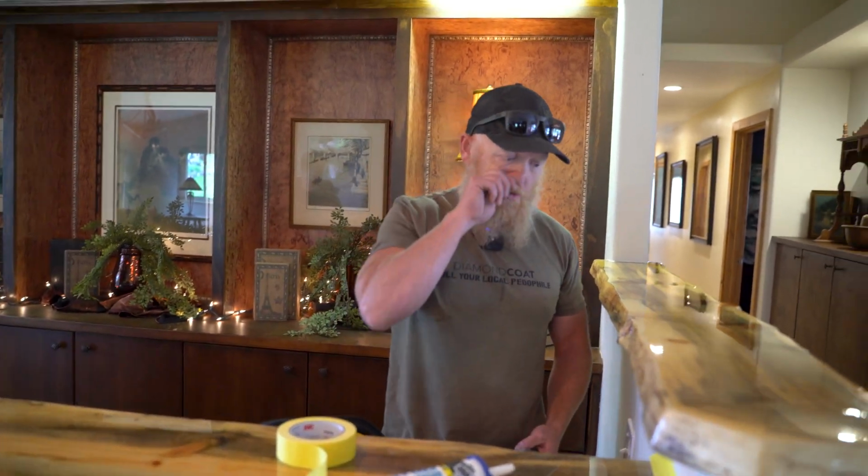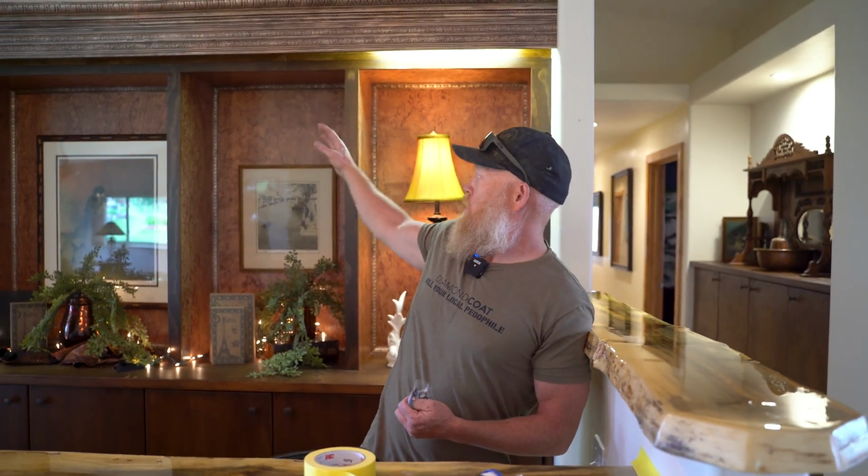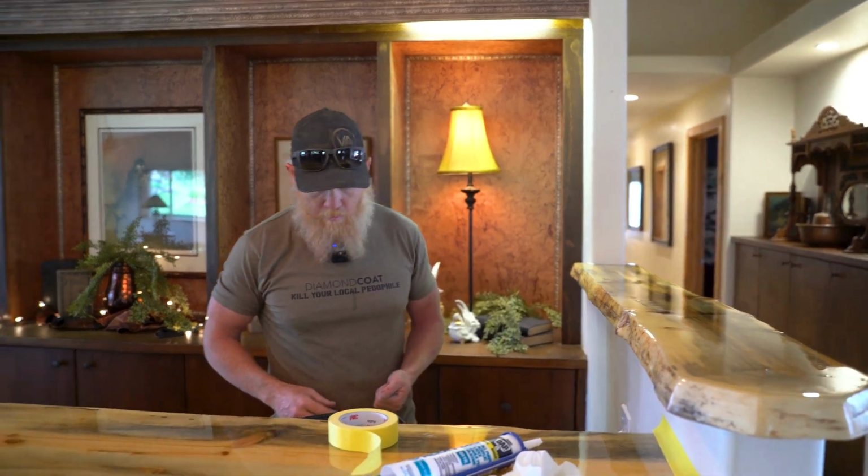And these knots are a little bigger than we thought to cut off. So just be thoughtful. A lot of people want to try to mitigate dust later, but they already created a big mess. So this is a very clean home, but normally, and I probably even will in here, I'm going to come in here with a leaf blower right after masking when I finish everything. And I'm going to leaf blow from the lights and the walls and just make sure, lightly, I don't want to disrupt her decoration in here, but I want to make sure there's no debris that's going to land in this during the cure. But one big part of that is just not creating dust in the first place.